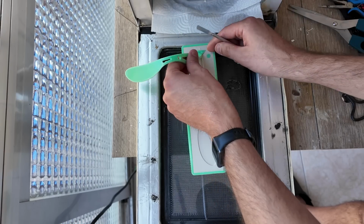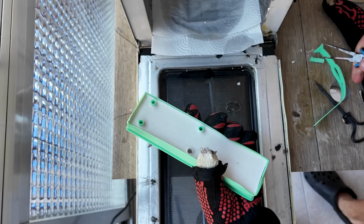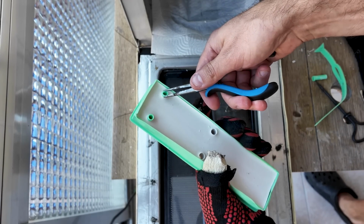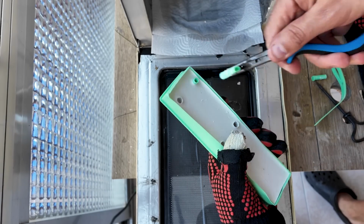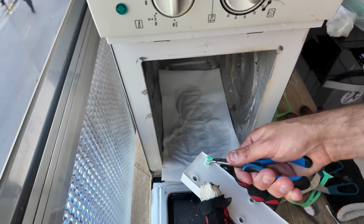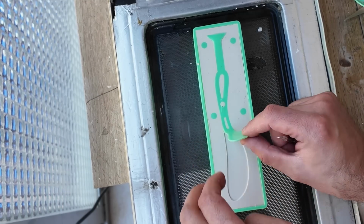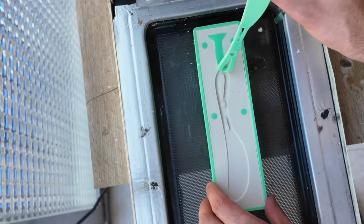You can actually keep microwaving your mold to remove even more moisture. There have been times that I microwaved it until it almost felt dry. But don't be fooled, only because the mold feels dry does not mean that there's no moisture in it. And microwaves can also crack the mold, so that's why I only microwave it as long as necessary. One more thing, if you microwave aggressively on full power, the mold can explode. So low power and step by step. And by the way, this process can be satisfying.